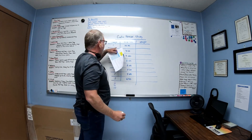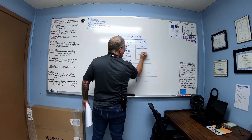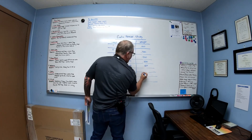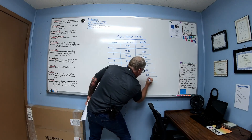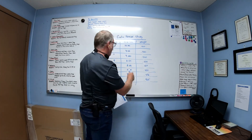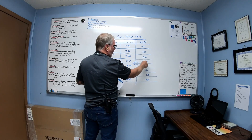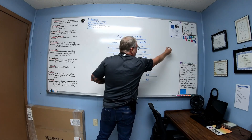You're going to start off with how much the part weighs. Let's say it weighs 500 grams. The next one you weigh it and it weighs 500 grams, then the next one 500 grams, next one 500 grams — then all of a sudden you start seeing some change. This one would be 489 grams, then the next one 480 grams, then 476, then maybe 465. You're trying to find out when the weight quits changing — right around that area is where your weight actually stopped moving.